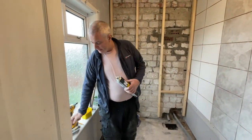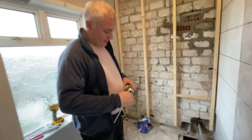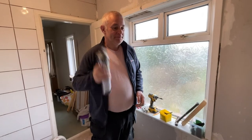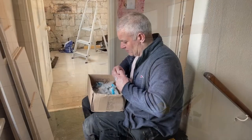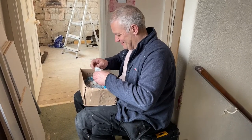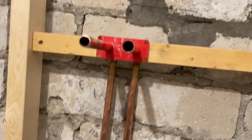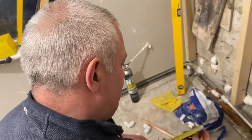Foaming up the holes. So we've got a number of holes in and around this very bad exterior wall. I'll put a bit of foam in to stop the wind blowing through from the cavity. So you're going to shake and foam, fill the hole. Now plumbing in the shower - bringing some pipework across here in plastic and then the fittings you'll see, which we made before, we've now cut down and we are piping them in to the mains water supply.